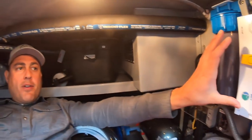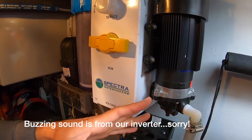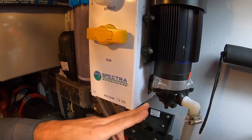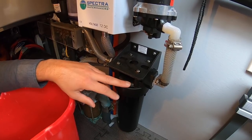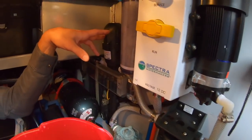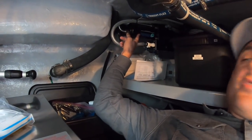The two main components of our water pump are right here. There's a selector switch where we can select where the water draw comes from. We have a feed pump pulling the seawater and pressurizing it to about 50 psi, then taking the water through a pre-filter — a 5-micron paper filter removing large particulate. It goes through an accumulator to normalize the pressure, and then that seawater is delivered up to our Clark pump and membranes.